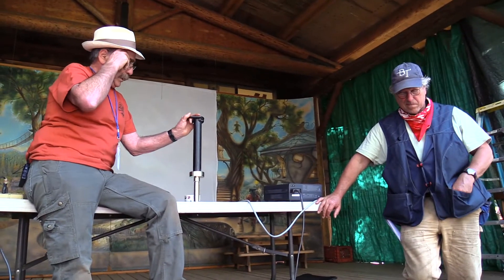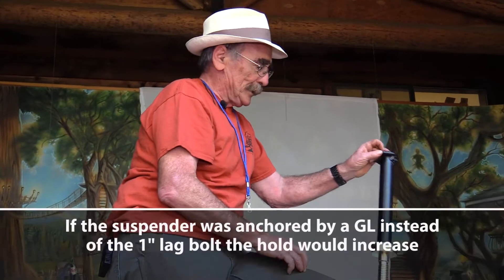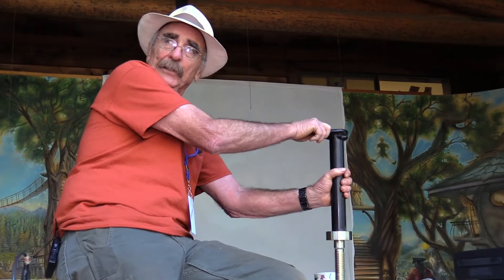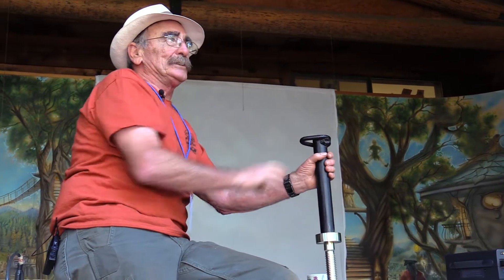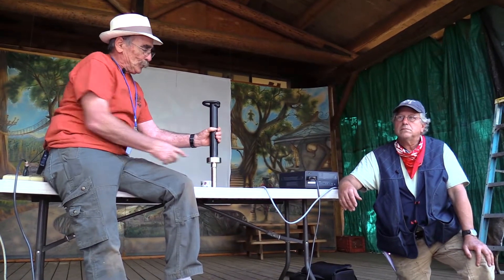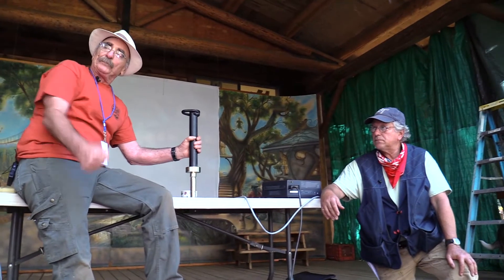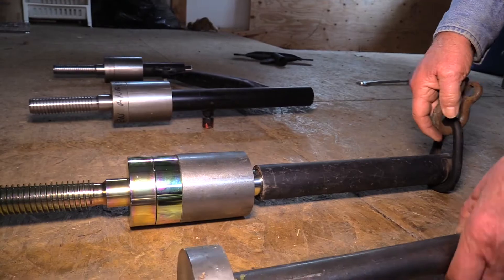I'm quite impressed with the hanging just from a one-inch lag. So you say you were able to double what the tab is rated for by itself? Right. Basically it's not a lever arm anymore. One of the reasons we did this is because if you put your weight out here without it, we know that it'll fail sooner — it won't hold as much weight because you've got more leverage. This was to take away that leverage, and it took it away very well.